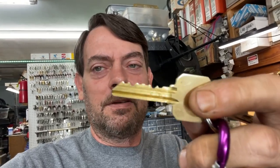I could have sworn, like I mentioned on Saturday Morning Live, that the ones that had this tin cut at the tip, which is very common coming out of the Schlage or the Sargent factory masters, when you order Sargent was one of the ones where you could order master key systems, and they were very, very happy with this tin cut on the end. However, come to find out, none of the tins worked in any of the other locks, and it actually ended up being this low cut guy that fit a large variety of them. So we're gonna get all these changed, and these keys will be no good after that.